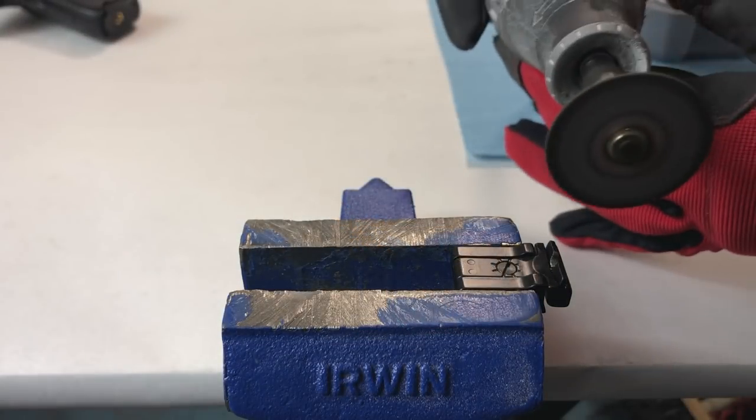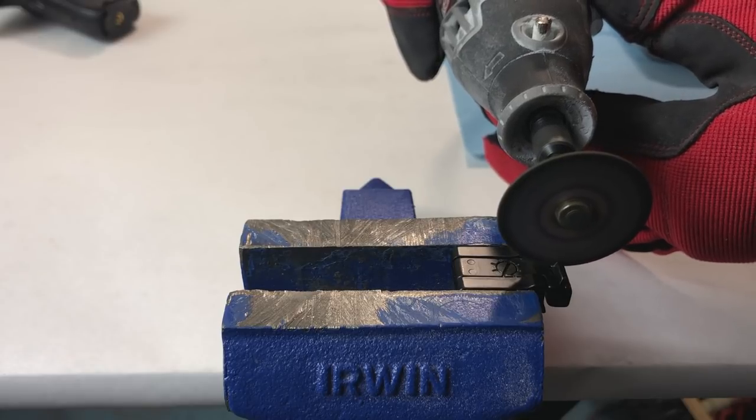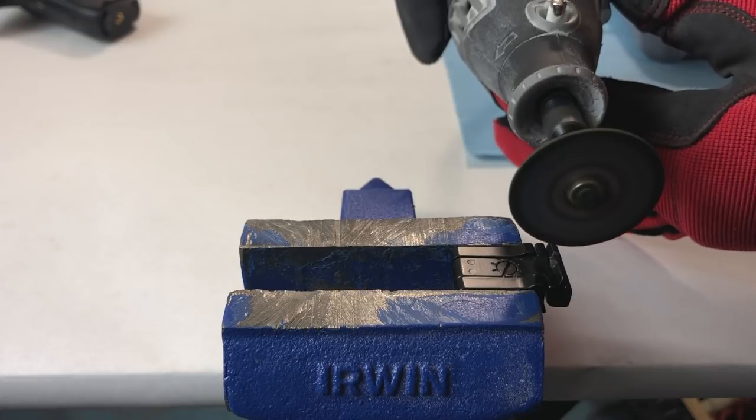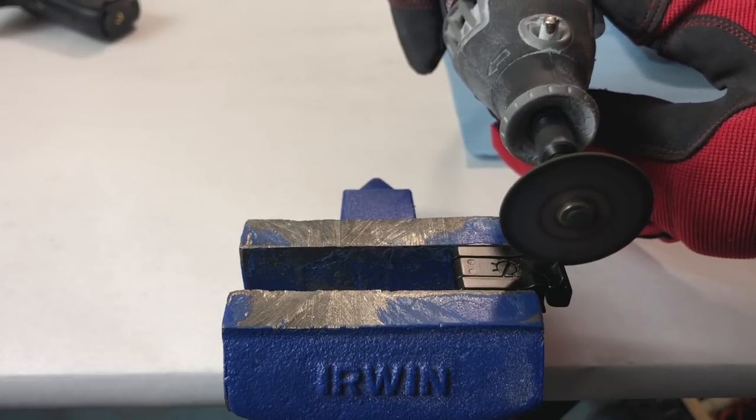The rear sight notch needs to be filed down flush with the flat part of the sight. The coat hanger rides a little low, so it is necessary to shave this out with a file or rotary tool.